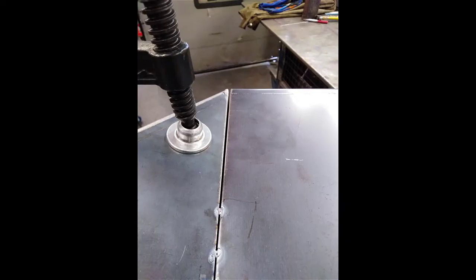In this view, you can see I've got quite a gap. Gap at this point is probably about 2 millimeters right on the outside edge. I will pull that in by heat shrinking my tacks that I've done previously. Once again, this is a bit complicated for a person that's learning, so you need to ask some questions at this point and you'll be shown what to do.